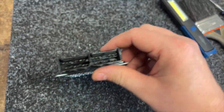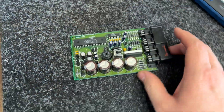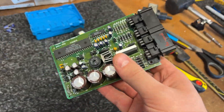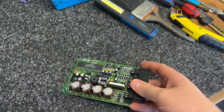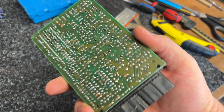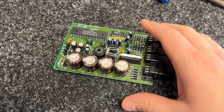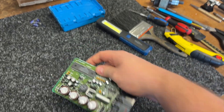Something a little bit different. This is an airbag module from a 1994 Mazda MX-5. As most of you know, I race MX-5s in my spare time — I also drive one on the road. But this is for someone else on a forum. On the 1994 model, the airbag module is known to fail, and it was only used in that year — 95 onwards had a different system. You can't buy these from Mazda anymore, and not many people are prepared to repair them, but I said I'd quite happily have a go. The common issue is the electrolytic capacitors start to leak, damage the board, and then you start to get warning lights on the dashboard. So I'm just going to replace all the capacitors on the board. Unfortunately my car is a 1992, so I can't plug this in to test it afterwards — we won't know if the repair is fixed until he fits it to his car.